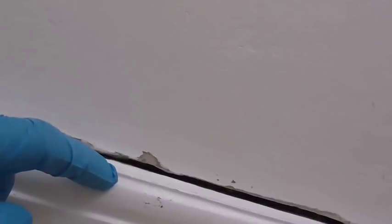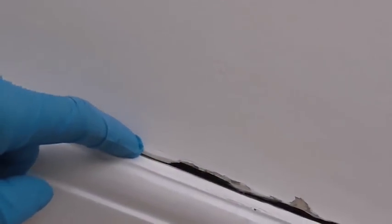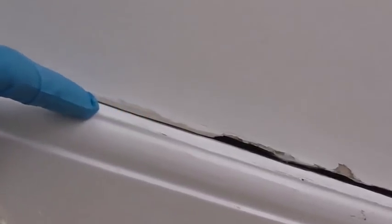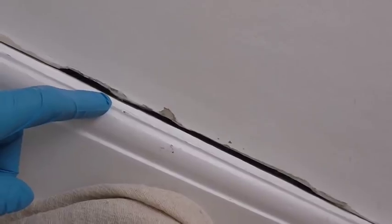After raking out it's looking a little bit different. The plaster here would have been bonded to the stringing with the crack running through, and then the plaster has gone tight — not bonded to the stringing. Up here where it ran back into the wall it's gone slightly bigger again because I've raked out the plaster from underneath, which wasn't bonded properly — bonded to the stringing but not to the wall behind. There are no visible signs of any cracking where it runs out, so I just need to sort this out. I'll open it up a bit more to make it easier to completely cure this.